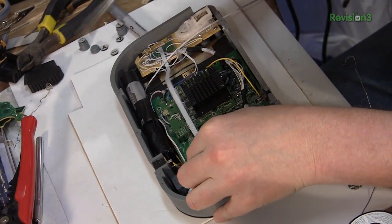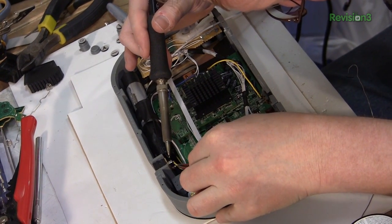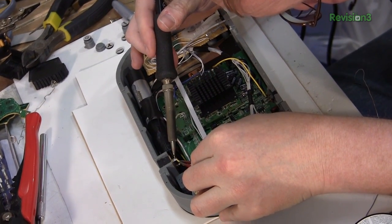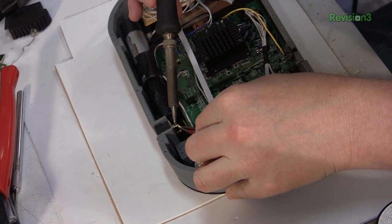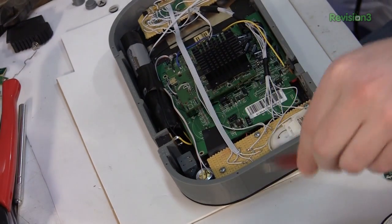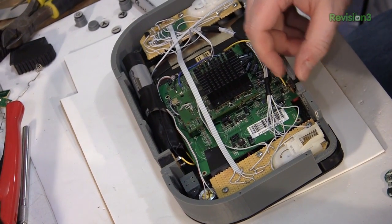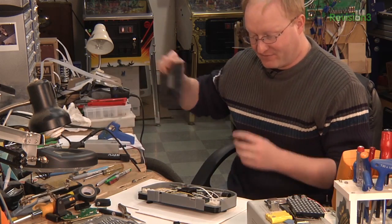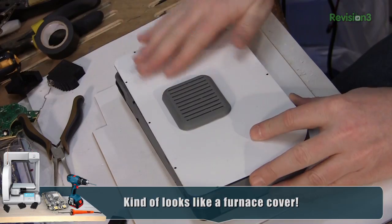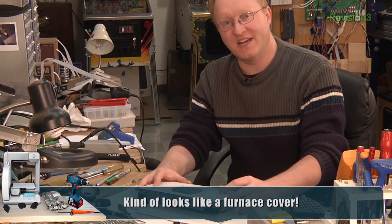I always want to make sure there are no completed circuits because I don't want to accidentally short out or discharge this lithium ion battery — because they're powerful, which means they can fail powerfully, for lack of a better word. I'm going to attach this to the switch, and this will be our main master on switch. Everything's in place. I've got my back lid here and it has a 3D printed raised portion, which is the grate to allow air in for the heat sink. We can screw this thing together and test it out.